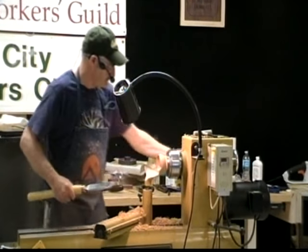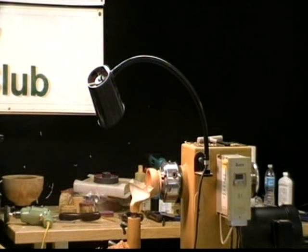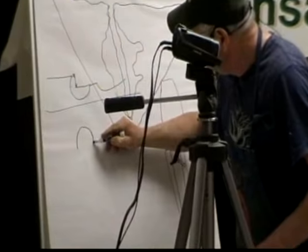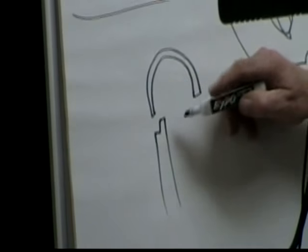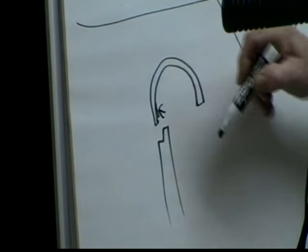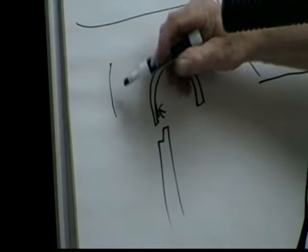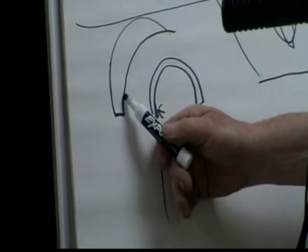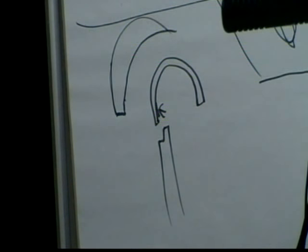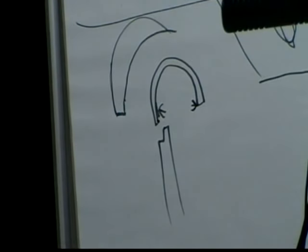Good. Now, the next thing about making a box with a lid is that if this is the inside of your lid, and it's coming down on a step like that, always undercut right here, right inside the lid. The reason you do that is so that when you come down on this step, it grips it positively. What people make the mistake of doing is doing this. That's the outside. They come down and they do this. And then when the top of the step pushes against here and it's loose, they don't know why. Do you follow me? So always undercut so that the grip is very positive right there at the corner. That is what grips the step.